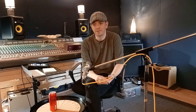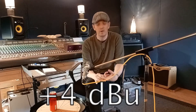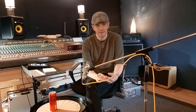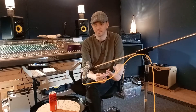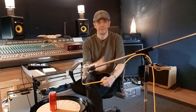However, there are two measurements we're talking about here. In the analog world, we're talking about line-level signal. All the rack gear that I have wants to be hit with a line-level signal — that means plus 4 dBU. When we're measuring decibels in the DAW, we're measuring in dBFS, which stands for decibel full scale. The difference between these is: when you're going plus 4 dBU, that's a line-level signal in the analog world.